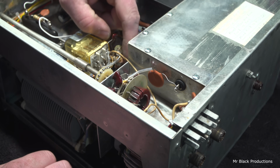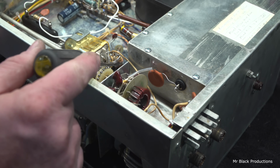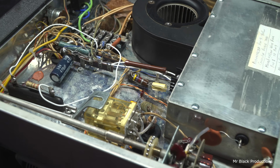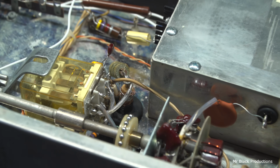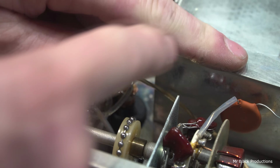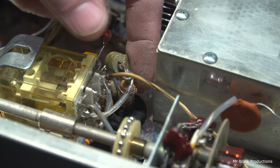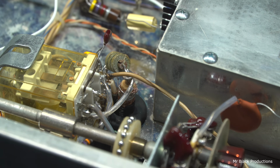This is our final output stage. Somebody took a lot of time and energy in wrapping that coax and soldering it. They were very delicate with their soldering iron, taking into account that's foam dielectric. What they did is they brought the shield up, they trimmed the shield off, and then they took a piece of wire and very carefully wrapped it around the shield, and then very carefully soldered to that wire and didn't deform the inner insulator. And I'm sure this was done before I was born, so I'm not going to worry about that either unless it presents to be a problem down the road.